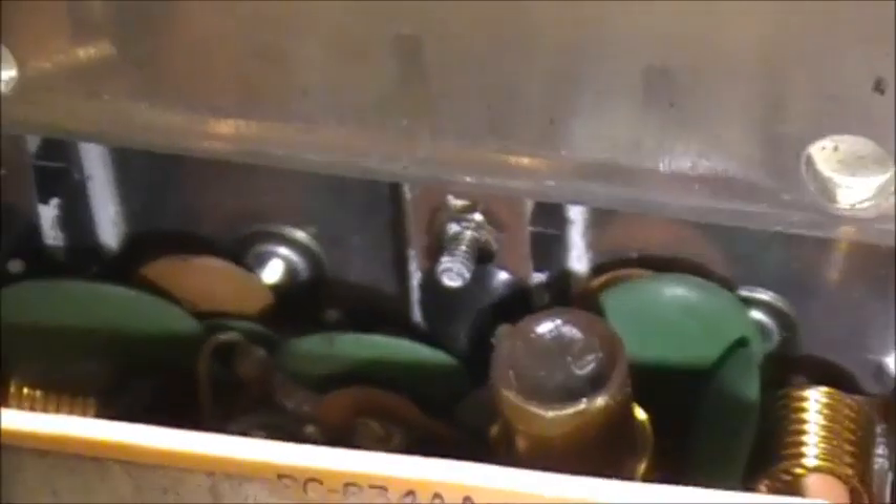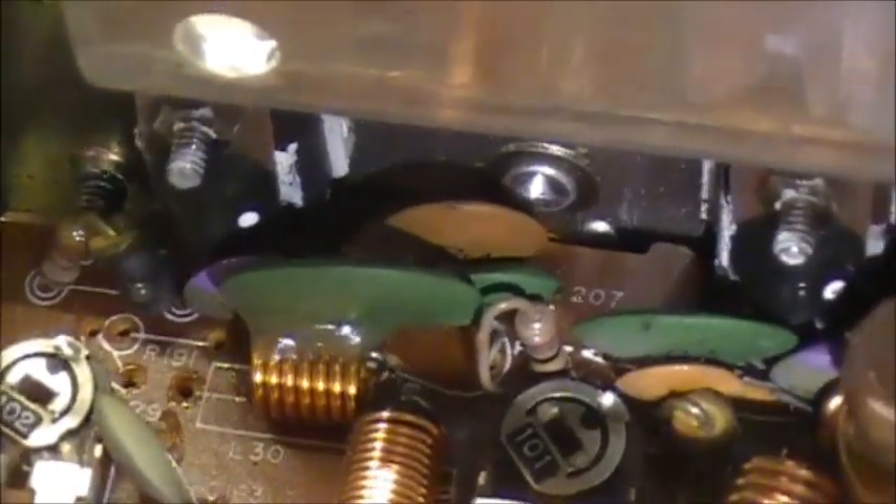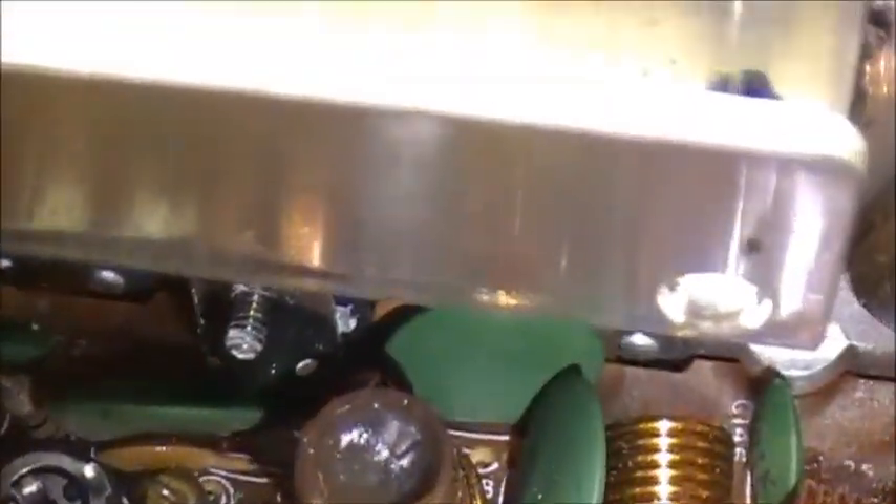There is a protection diode on the final, right here — it could be shorted. So we're going to remove this one now and see if that removes the short. If not, we may have a bad capacitor back here somewhere. But we shall see.